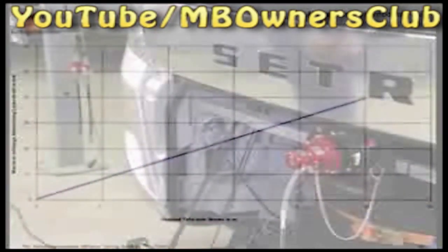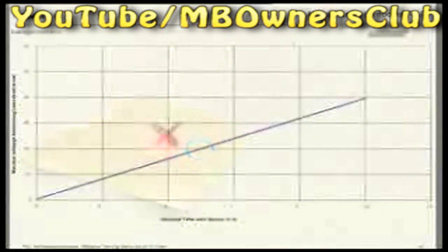The maximum allowable alignment tolerance is found in the OmniPlus bus dock. As a rule of thumb, the shorter the distance to the board, the smaller the alignment tolerance. At 10 meters, that's a maximum of 40 millimeters in radius. At 5 meters, a maximum of 20 millimeters in radius.